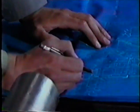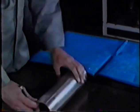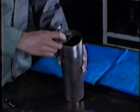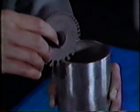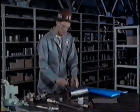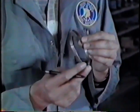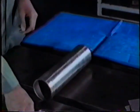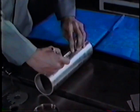When making up a joint, it's essential that you use the exact materials called for by the plan. Double-check pipe wall thickness and outside diameter. The fitting must have a smooth exterior surface opposite the fitting socket so that ultrasonic tests of the joint can be made later. In many cases, the rings are delivered uninstalled in the fitting, although some fittings may have them already in place. When you double-check yourself, you're sure it's right.